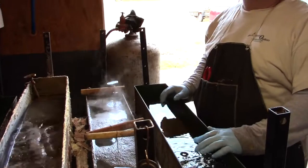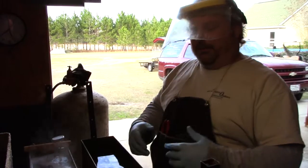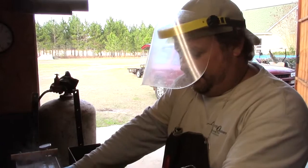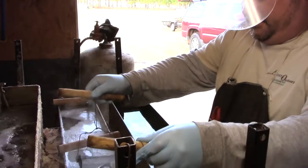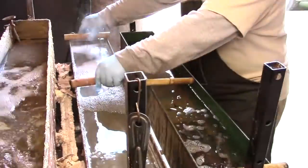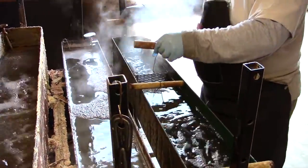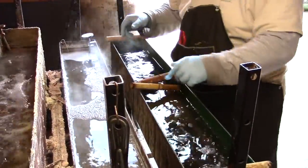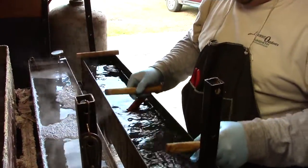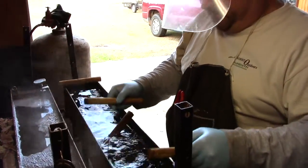It's been roughly about 30 minutes and we're going to do the second step in our bluing process now, which will take the firearm out of the cleaning solution and give it a good rinse. It's crucial to have a good flowing water tank. This will ensure that it gets all the soap and detergent off of your metal before you go into the bluing solution.